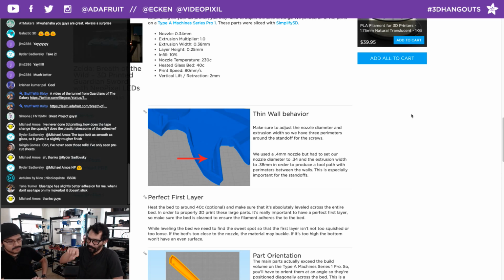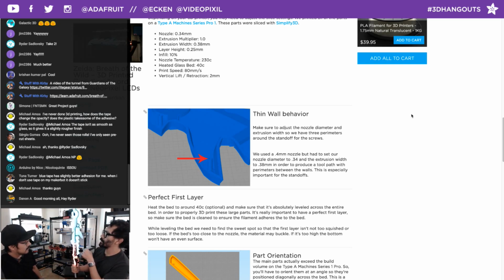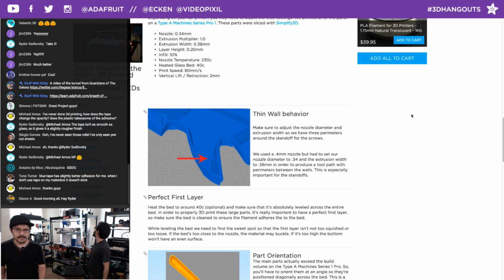It will definitely show through the design. You'll see all the infill patterns on the inside of that. You can kind of see them here a little bit, I think. On the sides, you can see them just because that's where the infill is, but for the sides of it, it's just solid. That's what's attributed to the strength of this, especially down here where they're disconnected. And the standoffs too, they're just solid perimeters. There's no infill in them. You do not want any of that zigzagginess happening, so it's pretty wall strong. Yeah, it's really strong.